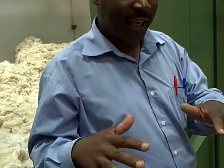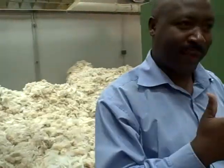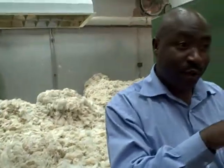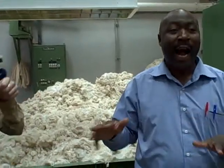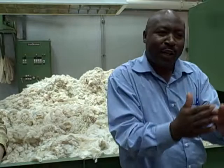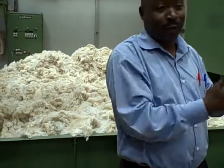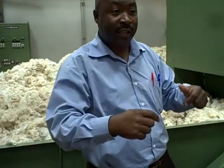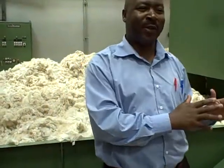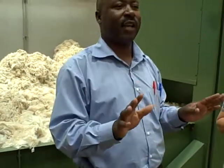I used to do it myself. When it is time for running organic and I've been running conventional cotton, what I do is first run out completely the conventional cotton — you have to clean everything out. Then I get two bales of organic, open it, and use it to clean the whole system. I regard it as conventional, not organic — it could be transitional. But in my sales process, I put it as conventional. Then I'm very sure that what will follow after cleaning is organic.